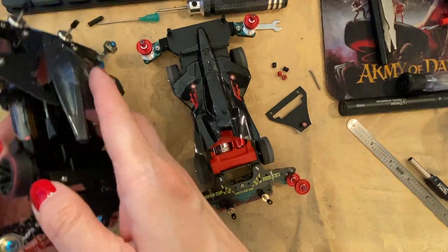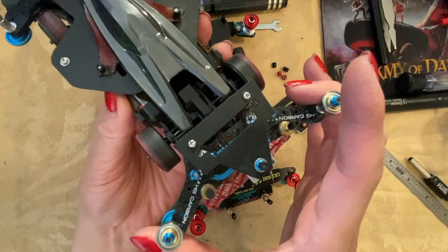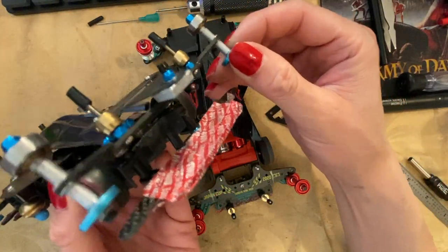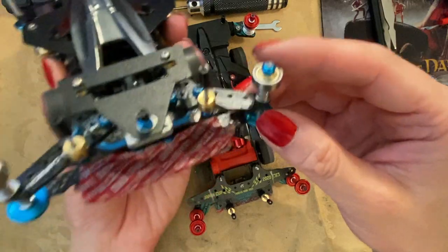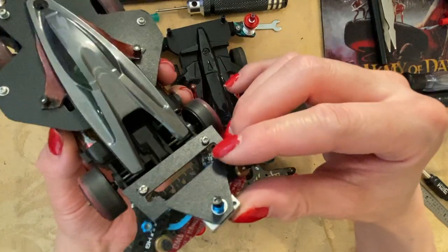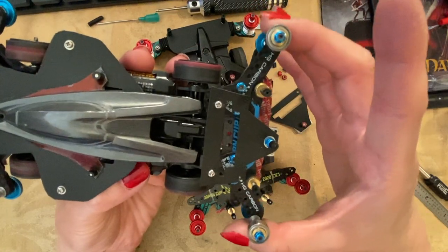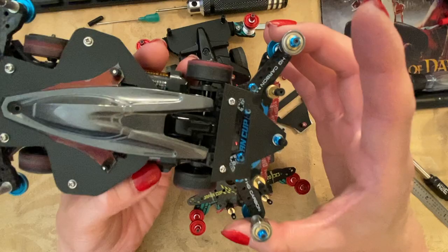On my pivoting systems, we started off here with Tarantula, and I've got the same kind of left-right pivoting system. It's a little looser though, and you can also pivot upwards. You cannot pivot downwards, so there's no upward angle thrusting. I basically prevented the upward thrust by using these two posts with rubber pipes. This was kind of a happy accident — originally I just wanted this thing to go up and down, and I thought the left-right tilting was actually a flaw. But I found out that you don't need to fix that.